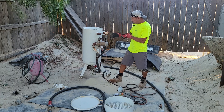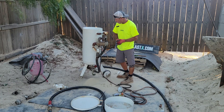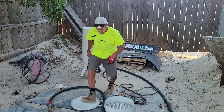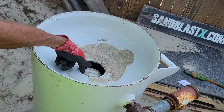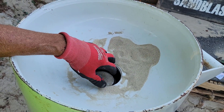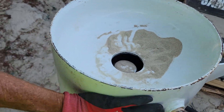This here is a choke — it shuts off the air to the bottom of the sand pot. When you put your air compressor to this, this is your valve. When you turn that on, it energizes this, which takes this cork and it hits in there and seals on this donut right here. This cork pops up against this donut — if there's sand in between there, it'll push it out of the way. Do not ever have your finger in here. That cork pops up and this thing is now pressurized.